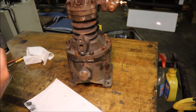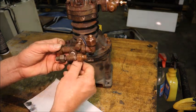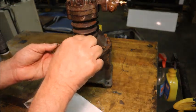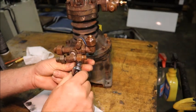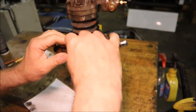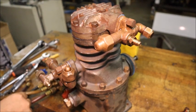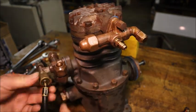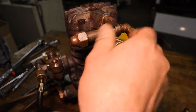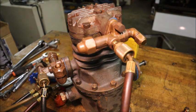Once all this is done we'll pressure check it to be sure it's actually holding. After the pressure check, the oil will go in, we'll put it on a test stand and run in the newly lapped shaft seal — I'll let it run at least 24 hours just with nitrogen flowing in a loop to help those lapped surfaces conform to one another. Time to do a little pressure checking — got the gauges hooked up with the valves open to the service ports so it'll actually go into the compressor. Gauge manifold open on both sides. Turning on the nitrogen — 500 pounds in there. Don't hear any obvious gross leakage, so that's good — going to go ahead and use the soapy water to try to find any small leaks.